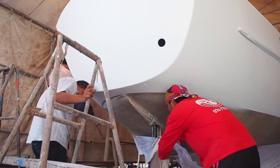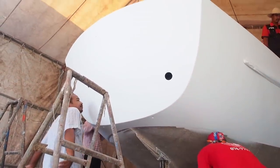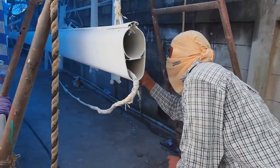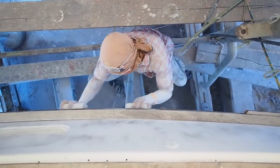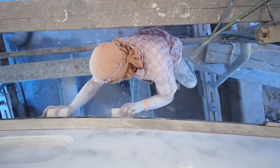While Jamie's busy creating new holes in the deck, the painters have been filling in holes on the hull. This week they applied a layer of high build, which is a thick paint designed to fill in minor pits and imperfections. It will be faired back once more before the Awlgrip 545 undercoat is applied.